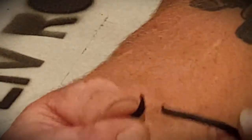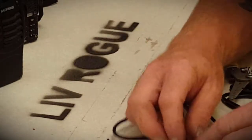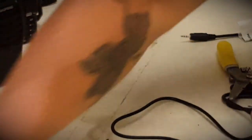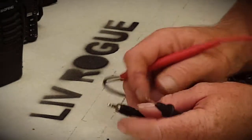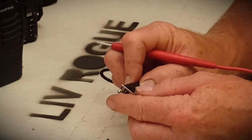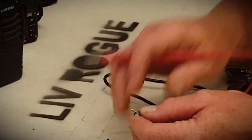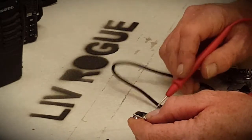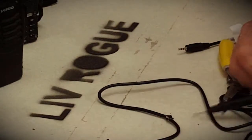Now manufacturers of the wires — it's going to be different. I've seen them where the ground wire is green, I've seen them yellow, it just kind of depends. We're going to determine and make sure that copper wire is the ground. Just to be safe, we'll grab a multimeter and put it on continuity test, so it's going to give us a tone. Like we talked about before, this very end section closest to the fat end is the ground. So if we take that, put it right there, and touch the other side of the copper wire — you can see that's the right one. If I go to the front pin, I'm not getting any signal on either of the other pins. So I know for a fact that copper wire is the ground.